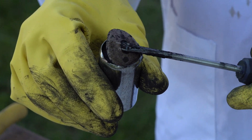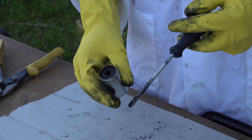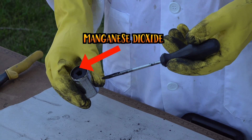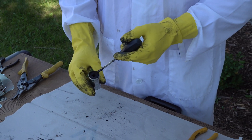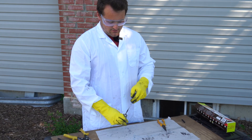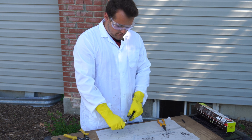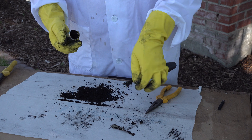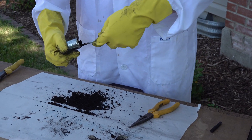Next you are going to take your screwdriver again. This top part here is just a piece of paper that you can throw away as well. In the casing there is this black goop, and that goop is manganese dioxide. It is the other component that is important for the battery. It has a consistency like slightly dried mud. Basically you are just going to stab into it with a screwdriver and wiggle it out. As you near the end you are probably going to be ripping out pieces of paper — any time you see paper just set it aside and we will throw that out when we are done.